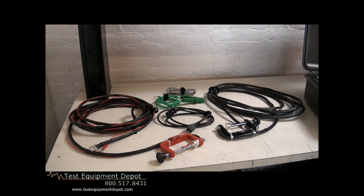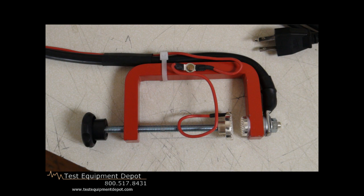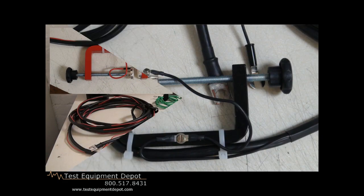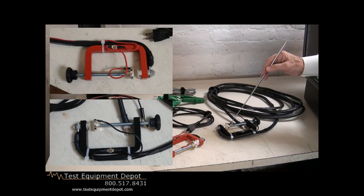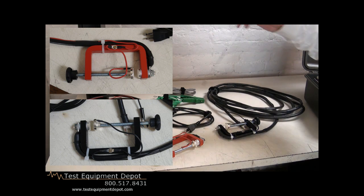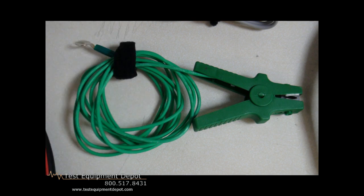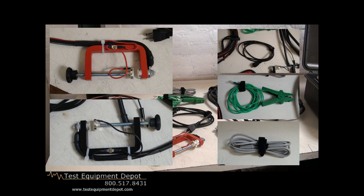Now these are the auxiliary components that come in the kit form, starting with the high current connections, which go to our test specimen. And these are the classic Kelvin connections, whereby we have the injection connections and then we also have the voltage connections. So we inject on this side and we sense the voltage here. Then we have our mating return path for the high current, and we have the other half of the potential monitoring. If we know what the current is going through the test specimen and we know what the voltage across the junction is, we then calculate the resistance. Because we have brought the sensing leads right out to the point of contact, it eliminates the resistance of the leads themselves. We have the power cord, and in the case of high inductive voltage, we have a grounding strap that can be put on the test specimen and brought over to the test box. And of course, we have a USB port for downloading and the cable.